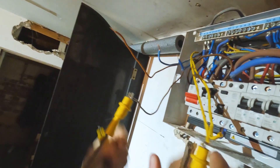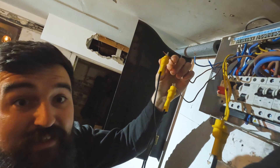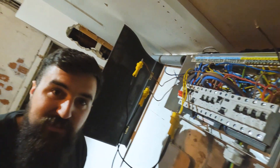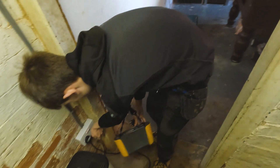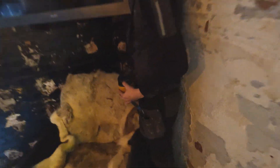These little jump leads are brilliant. That's the line of one side connected to the Earth of the other. Then same again for the other side. There's this random cable in there - wobbly - so we'll disconnect that and put it on the 16 amp on its own thing, because you can't have three in one, it's not even secured. It's labeled kitchen sockets but it seems to be doing these basement sockets - so I'll put C1 on that. That is how you do a ring test.